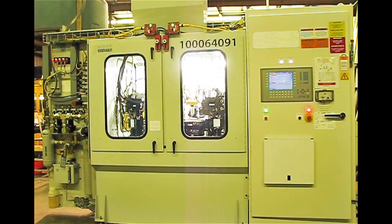Each tool station is mounted with a lubrication system. The lubrication system is pulse-actuated. It has a 6-liter reservoir on it, good for about 200 hours of operation.